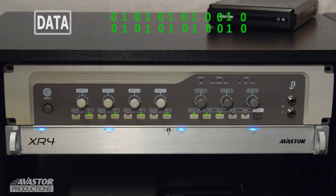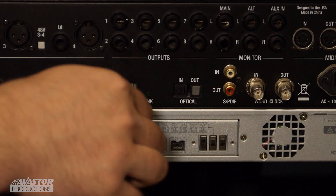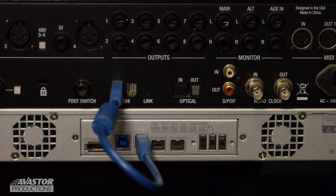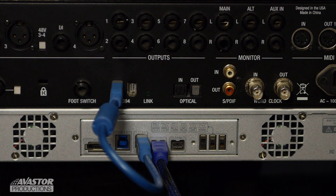To illustrate: if FireWire 400 is first in line, the devices next in line can only use that FireWire 400 speed, which is half of FireWire 800. If the FireWire 800 device is first in line, then you get the full use of speed. To reiterate, the 003 is the last link in the chain, the XR4 is number 2, and the HDX1500 is the first link in the chain. Since the XR4 also has a FireWire 400 port, we're going to connect the 003 to the XR4 via FireWire 400. You could also use a FireWire 400 to FireWire 800 cable if one of your devices doesn't have both types of FireWire ports.